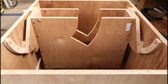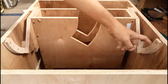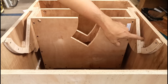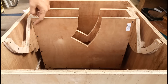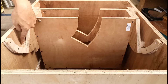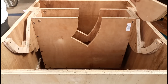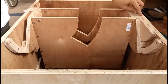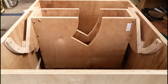And this is how it looks from the side. The bottom trunnion, items 18 and 19, is attached on the cabinet, and item 19 is attached to item 17 — they are attached to the housing. The same thing goes with the front trunnions. Items 20 and 10 are the top piece that would secure the trunnions from moving side to side or up and down.